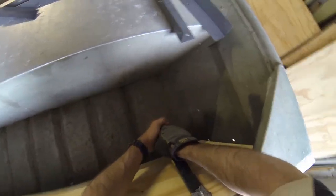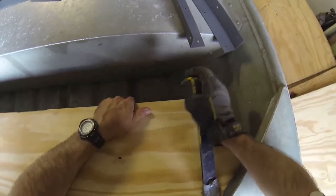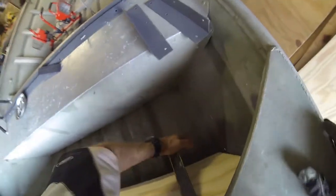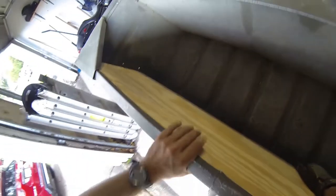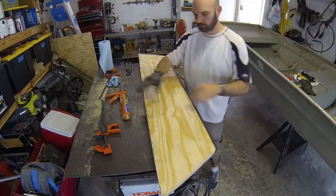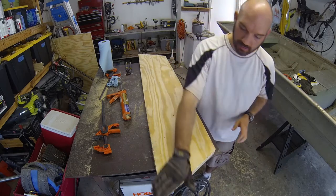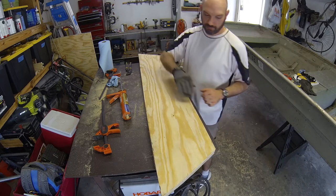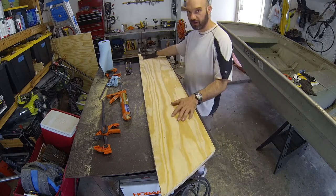The previous owner tightened the motor down with a rotten transom, which bent back the aluminum channel — which is why these things need to be repaired. That's feeling pretty good, and this is why you dry fit the stuff. We're still going to have to braze that out. So we got our two pieces cut out, did the dry fit to make sure they fit in the boat. We also routered them so they have nice flush edges — they're both pretty identical, it's going to fit more smooth in there.